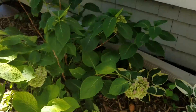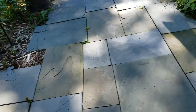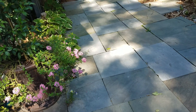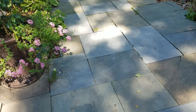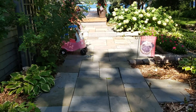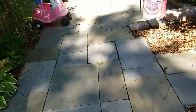About 75% of the bluestone is reusable — for the most part it's in decent shape. I told him we would give him some credit for it, but there is labor involved in taking it out. They currently have super tight joints, and I told him we would not lay it that way. Because we're close to the water table, I assume they get lots of freeze-thaw, which is likely causing some of the breaks in the pieces.